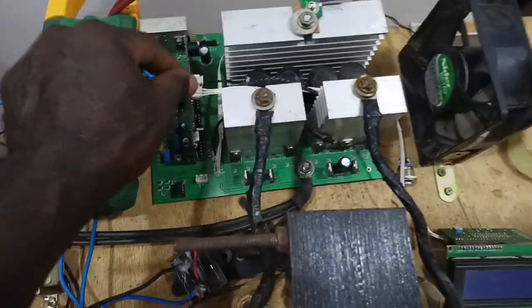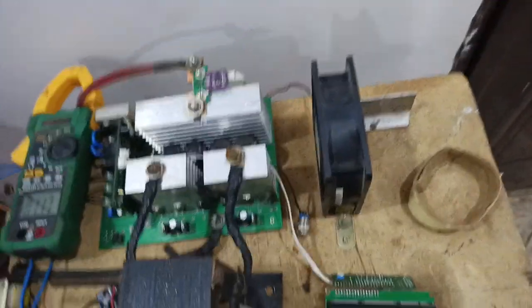For this inverter, I programmed the card to handle only 750 VA of power. With a power factor of 0.8, that means around 600W of load the inverter can carry. If I exceed 600W, the inverter is supposed to shut down. So, let's just run this small test.